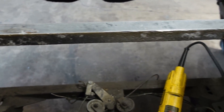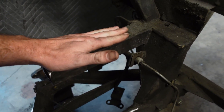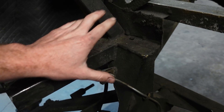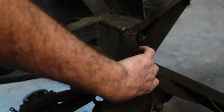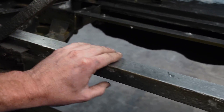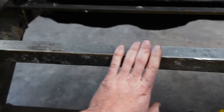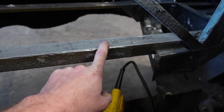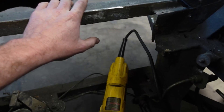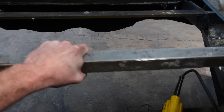Now it's smart to show you guys what I'm doing and why. We've got our original upper control arm mounts here that we need to re-brace and re-triangulate, and there's a lot of structure behind them that is honestly the primary structure for the back of the car — it really supports the entire thing. Up above we've got this cross member, and this is what we were aiming to get to in the last episode. However, I've come to the decision that I want to move this. It doesn't serve a ton of purpose right here. I'd rather locate it in plane between these where the structure is more needed, because we're not going to have a trunk floor right there anymore.